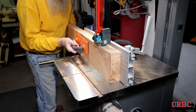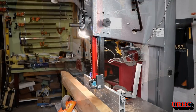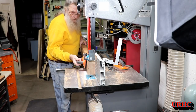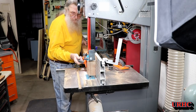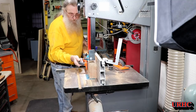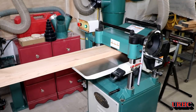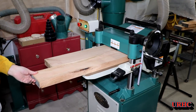A good thing you can see is that the plank I'm removing is staying perfectly straight and even as I'm cutting it off, which means there's really little to no stress in this lumber. That's a good thing to help keep everything flat. Sometimes you'll get a piece that wasn't dried properly and it'll start curling away.